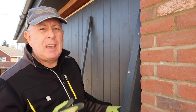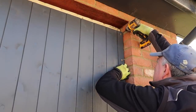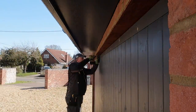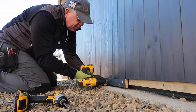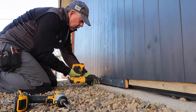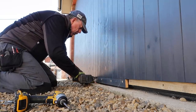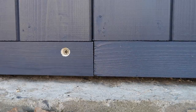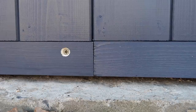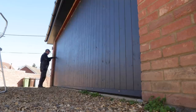So I'm just going to do simple butt joints and if they do open up I don't think they're going to look nearly so bad — that's a theory anyway. So once I get this on then I can get on the inside and finish the inside wall. I used external screws to fix the trim all the way around. At the bottom I had to split the trim into three sections as the middle one is connected to the door and will obviously come out with it when I remove it. I put a 10 degree mitre on these front to back so the side pieces sit slightly behind the section that's connected to the door. This will make it easier to pull out the door and hopefully hide the joint. The countersunk screw holes could then be filled and I was ready for another coat of paint.